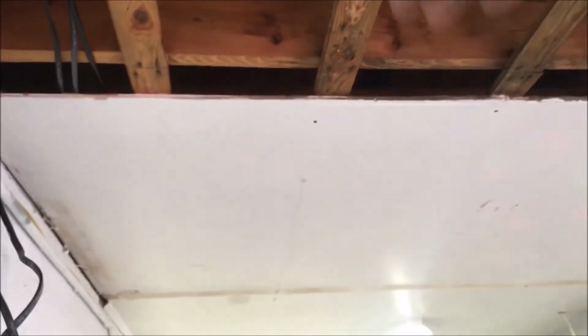That way I can screw in anywhere and not have to worry about the sag like I had here. And once I get that back under here, then I can screw here and it'll pull it up too. But now that I've got access all the way across, I'll just slide it up in there and then slide it back in here and screw it into them two beams there. And then I'll have a solid plank floor basically, or ceiling. And then I can screw my drywall right to it. And I shouldn't have to worry about any whoop-de-dos or whatever you want to call them.